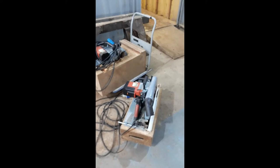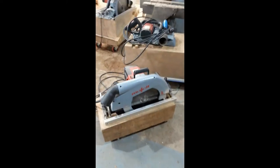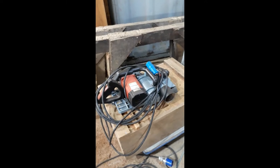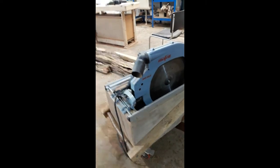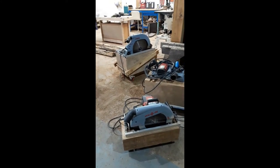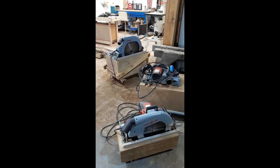Some of the tools we're using: for the more recent rips I've been using this saw, which will cut about 130mm deep — about five inches. When I've had to plane a flat surface, I've been using this power planer, which is just over eight inches wide, 205mm. And earlier this morning I was using this — what we call Big Bertha — this saw will cut just shy of eight inches in one pass, doing my big rips. These are all made by a company in Germany, very high quality pieces of kit, and cost an absolute fortune, but they're the only things that would easily re-dimension timbers of this kind of scale.